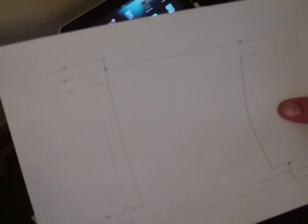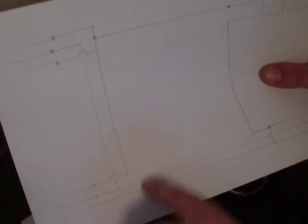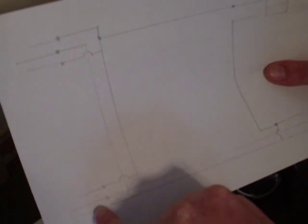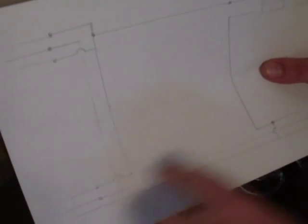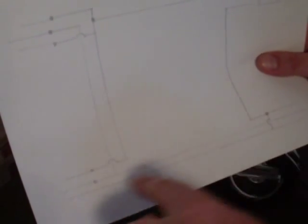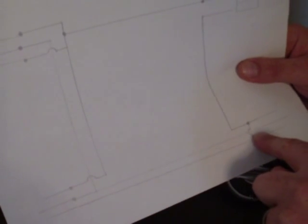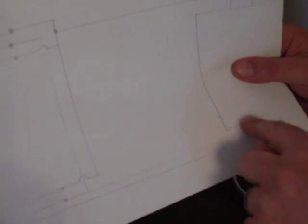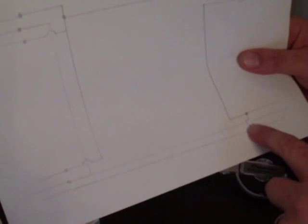Right, you'll have to bear with me on this, and I'll see if I can make it as clear as possible. What we have then is, this is the input down here, and we've got three connections. So the middle one is the ground, and we have a left and a right. The grounds connect all three sockets together. So there's wiring inside the box that just connects all the grounds together. The right-hand channel goes directly across to the output, the headphone socket, and I've cross-linked the left and the right channel pins so as to create the mono image in both headphones.